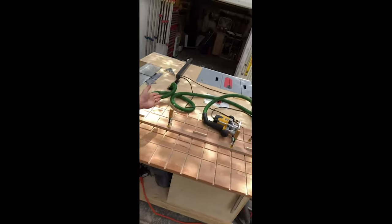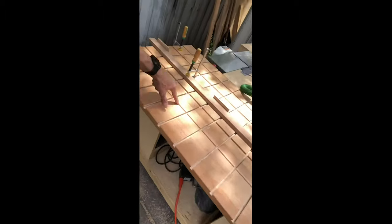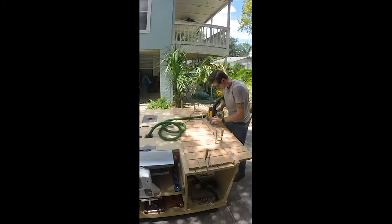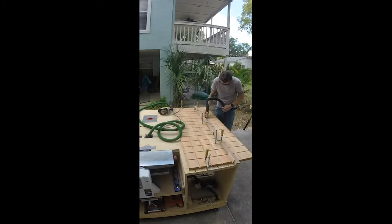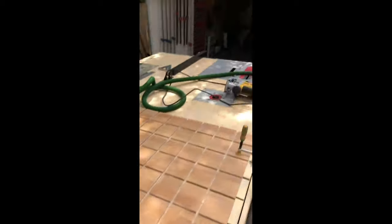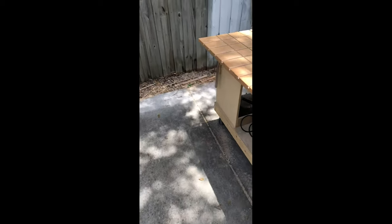One more track to cut — I've got all of these and all of these. Last one is just this guy right here, and it seems like something I'm definitely going to mess up, but fingers crossed. I did it! I cut all these tracks and removed a lot of material, which releases a lot of internal stress in the wood. I opened the pores and exposed it to moisture, and solid wood is always going to be vulnerable to temperature and humidity changes. So I'm going to seal it up with some cheap finish — just to protect it from sunlight, rain, moisture, and temperature changes. This thing is going in my shed and it's a utility project, so it doesn't need to be the best stuff.